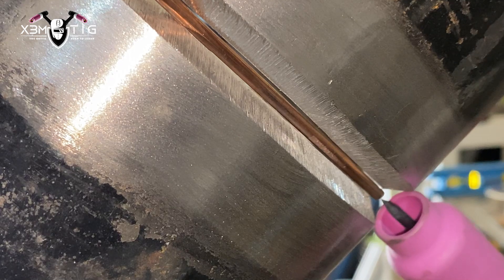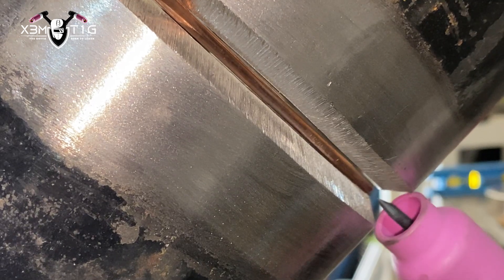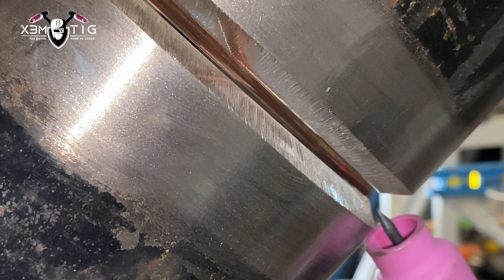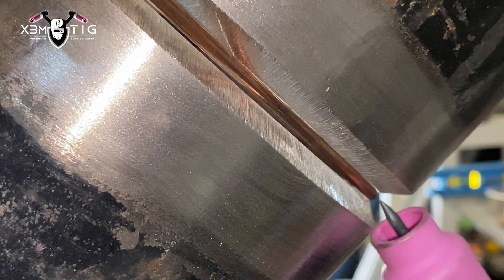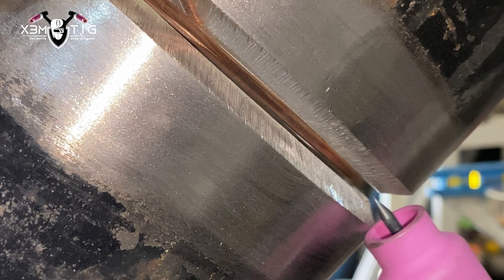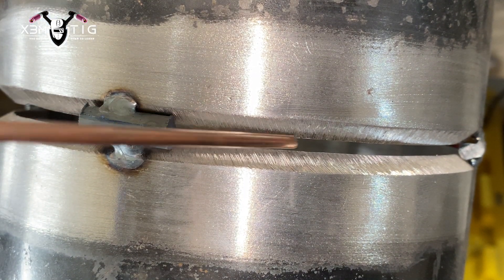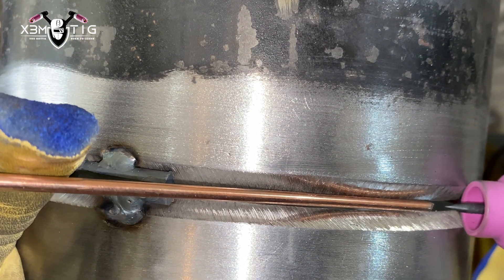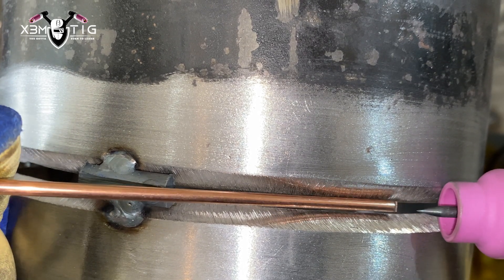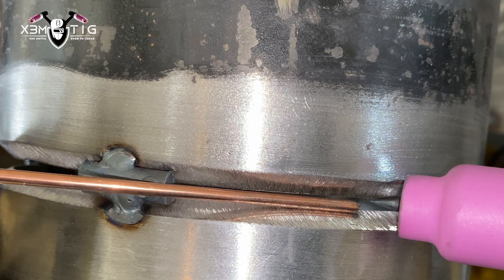On the bottom part I'm going to walk the cup, feeding rod on the side — not much back-feed. You can do back-feed on smaller diameter pipe, but on bigger diameters you want to go to the side. You can freehand or just lean the cup against the pipe for a little better control so you're not too shaky. Then on the top I'm just going to keyhole it. The gap there is a little bit tight, but on the top section it's not that critical — you can always go up 5 to 10 amps to open it up faster and just dab the rod and keyhole it.